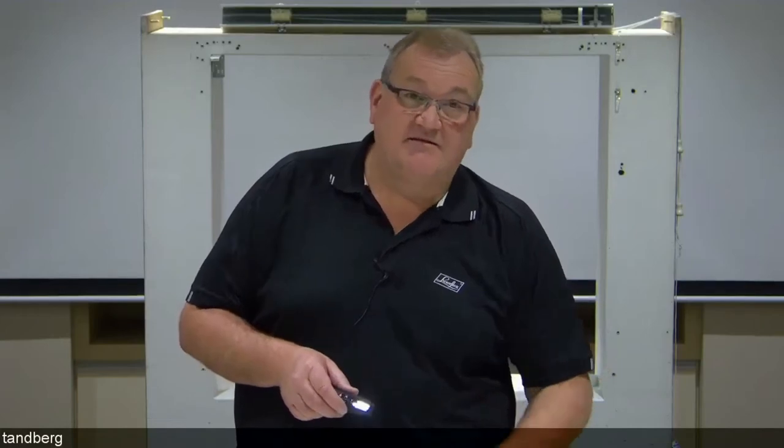String tape spacing also plays a big part in product cost. For our Country Woods timber Venetians, the ladder spacing is 560mm. For Wood Essence, it's 400mm — because Wood Essence is a heavier product and we don't want to see bowing or sagging in the blades. We've kept tape spacing at a conservative level for a better product, whereas many competitors use wider spacings to reduce cost.